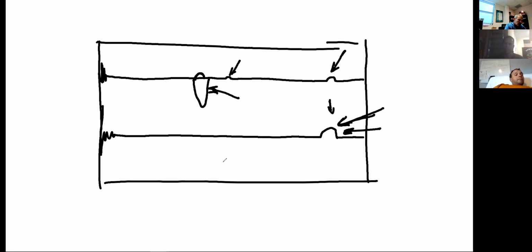Perfect. I'm going to call my guy on the radio. I'm not 100% sure we're at the cable end down here. Can you go ahead and ground it? He says, I've got the ground on. This thing is going to do like that. Take the ground off. It's going to go back up. Put it back on. It's going to go back down. You have now verified the cable far end.